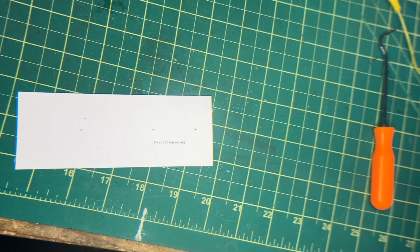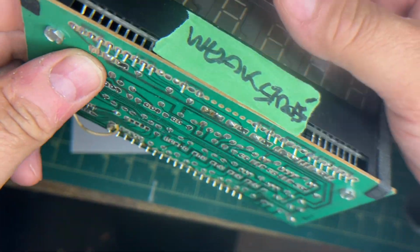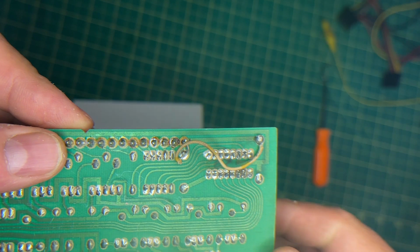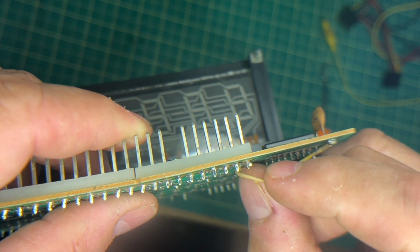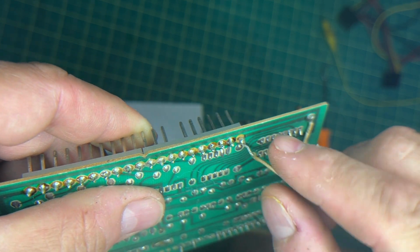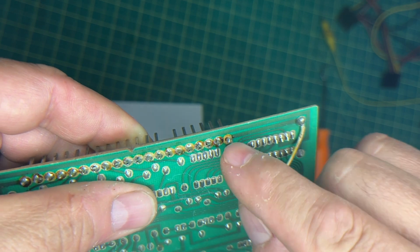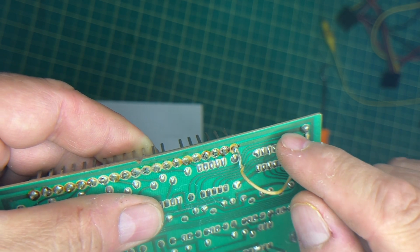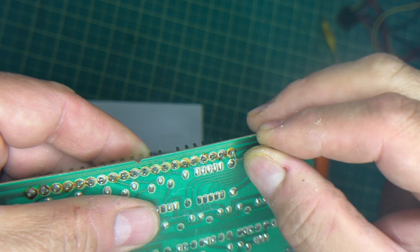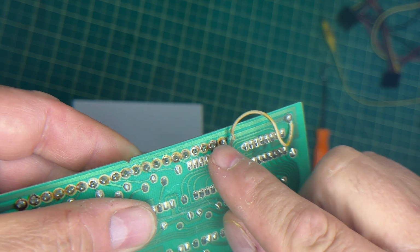let's look at one of the ones that I had labeled as works, weak. It says weak and strobe. Well, lo and behold, someone's been here before. And look what they've done. So the pin is broken. The trace is completely broken. Okay, so they used a wire to go trace to trace to make it continuous. But what they didn't do is here. They didn't attach it here because this trace also comes down.